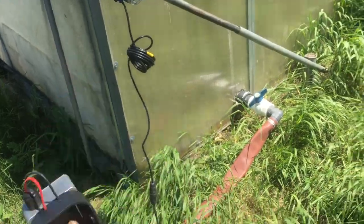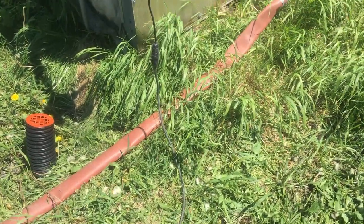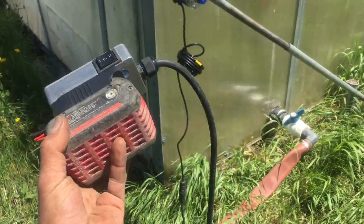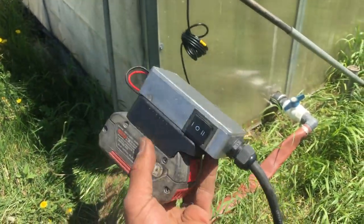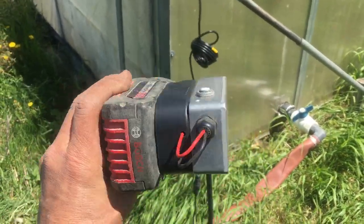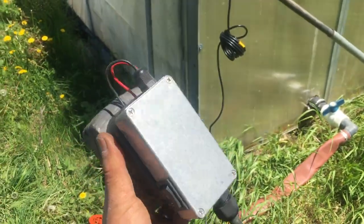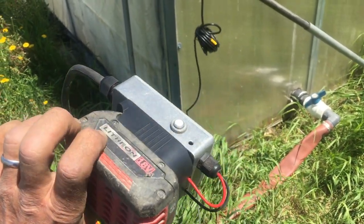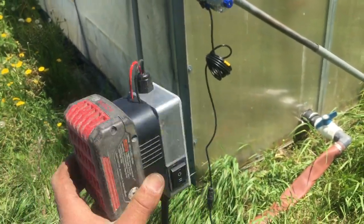Which is handy because here on the farm we have Bosch packs and my home power tools are Makita. Pretty simple. I'll try to post a photo of the wiring inside — it's pretty straightforward. The switch changes polarity and the breaker interrupts if it overheats.